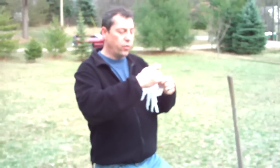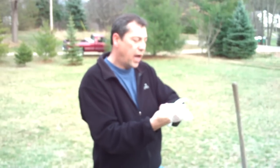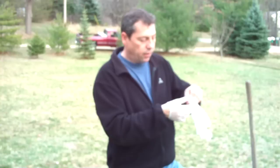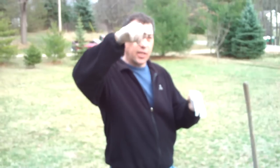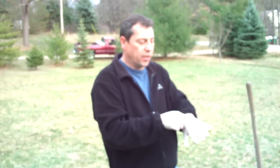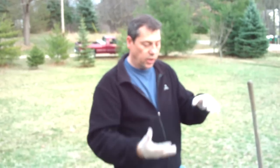A simple way you can do this is take a board. What I use is a 2x4 cut in half, and I mark it every 6 inches. I start at the bottom, so I'll come up 6 inches, make a mark, and then I put a 1, and then a 6-inch mark, and then a 2, and so on. And so when I put that stick inside the tank, number 1, I can tell what the total liquid level, operating level is. For example, it might be 3 foot, 4 foot, 5 foot, 6 foot.